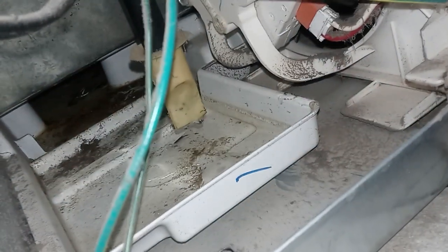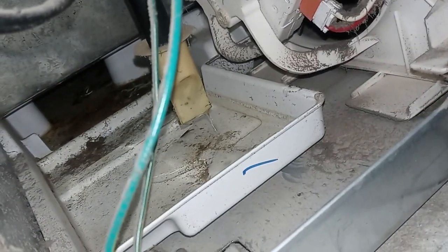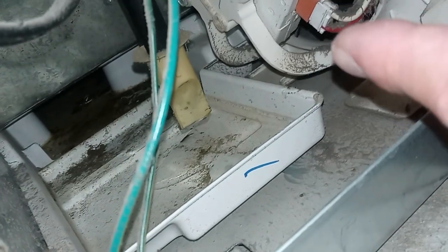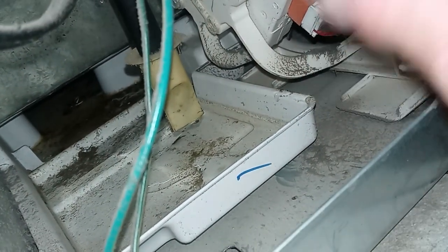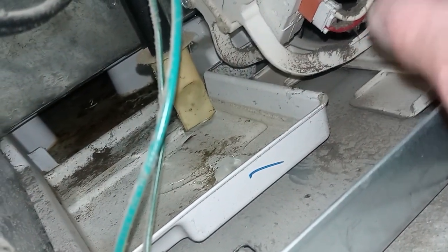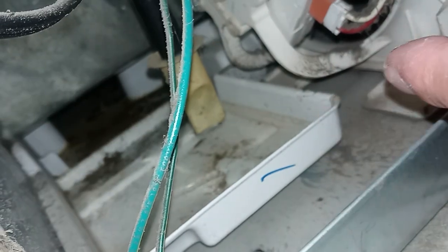And you can see, guys, this is the drain tube here, and they have this piece. What this piece does is it kind of just stops. It's kind of like a membrane where the water seeps through, and they put it that way so the water doesn't come through at too fast a pace. There have been instances where these drain pans have filled up and overflowed, and people had leaking fridges from the bottom of the fridge because too much water was coming out too fast. In our case, it was the complete opposite. There was no water draining out at all.